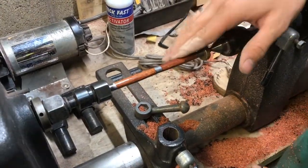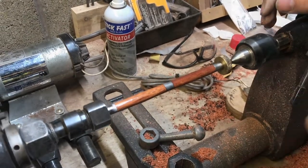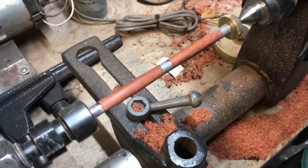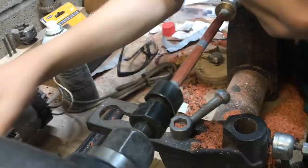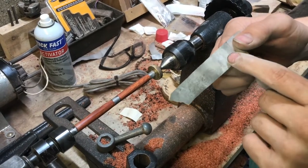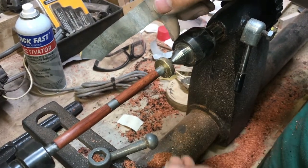This is what we want it to look like — very smooth. Sanding before we put these coats on made it a lot easier. So I'm going to sand 600 from end to end and then start moving up the grits. Now everything is perfectly flat with the 600 grit. We're going to move up to 1200, then 1500, then 2000. You want to inspect your sandpaper wherever you were sanding — if you see any orange color of the wood on the paper, you need to inspect the piece. Check if you have any holes in the finish or if you've sanded through, because that sawdust pickup is a dead giveaway that you have a hole in your finish. Lastly, we'll do 2000.